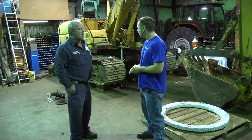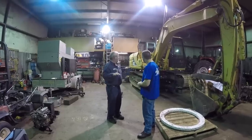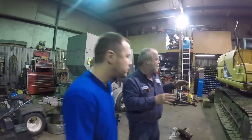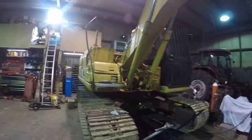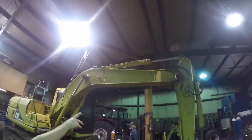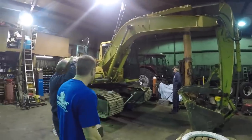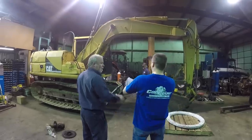So with all that, what's the next steps here? Well, we've got it jacked up, got it on blocks, on machine-owned stands, got the overhead hoist hooked to it just for safety. I've got two big stands back there, actually welded across the cross piece and welded to them so it's stationary and won't rock — one's turned sideways, one's turned forward, so there's no rocking. The boom is holding weight, and the crane is hooked to it just for safety so nothing shifts while we're working. Those two big jacks are holding the carriage right in the center with all the weight on the jacks.